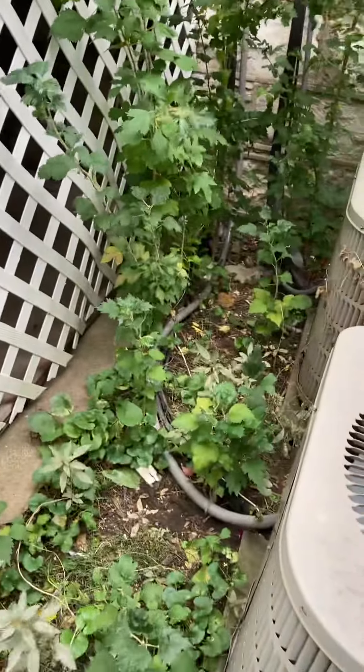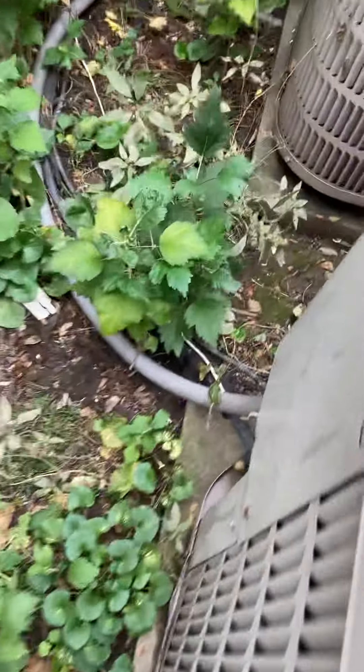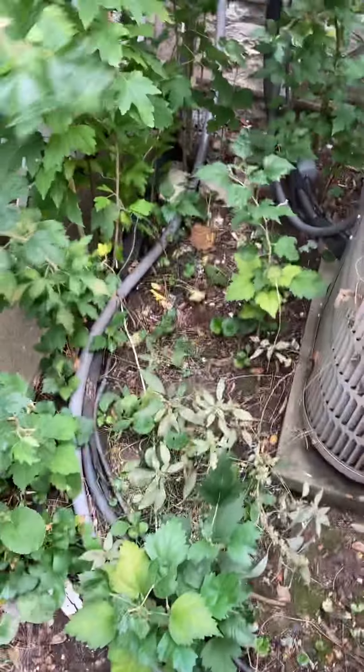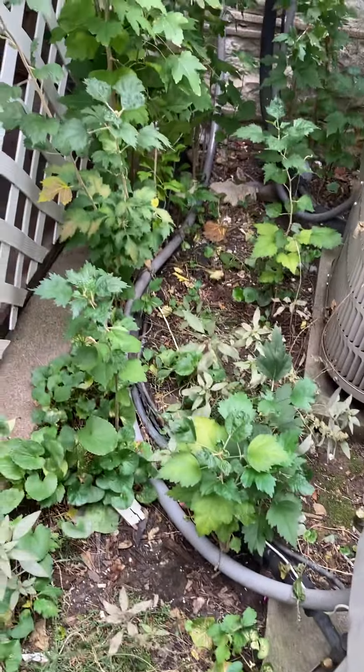The whip and the line sets are both running into the basement. They're both sized right — three-eighths by three-quarter. We'll need to reinstall insulation on the suction line if we reuse the piping and flush it.